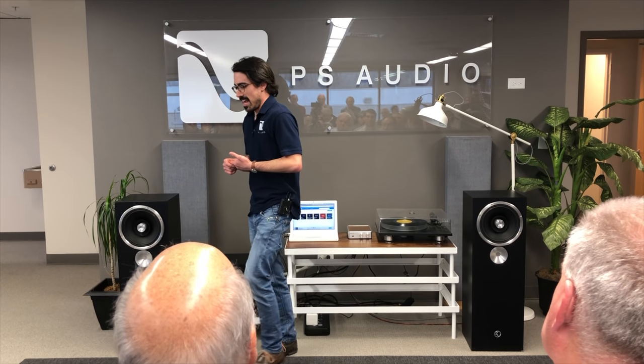I find a lot of Phono stages sound very similar to me in the lower price ranges, and there's a reason for that: a lot of them are using the same amps. I don't know how many of you are engineers or into the technical stuff, but you're going to see OPA2134s everywhere, and a variety of modern integrated op amps, which are extremely high performance. They offer good measurements, but in the end, they're the same Phono stages over and over. There are three types of RIAA equalization. You can do a passive, a hybrid, or a fully active. Those are your three RIAA options, and there's also an LCR that's very rare.